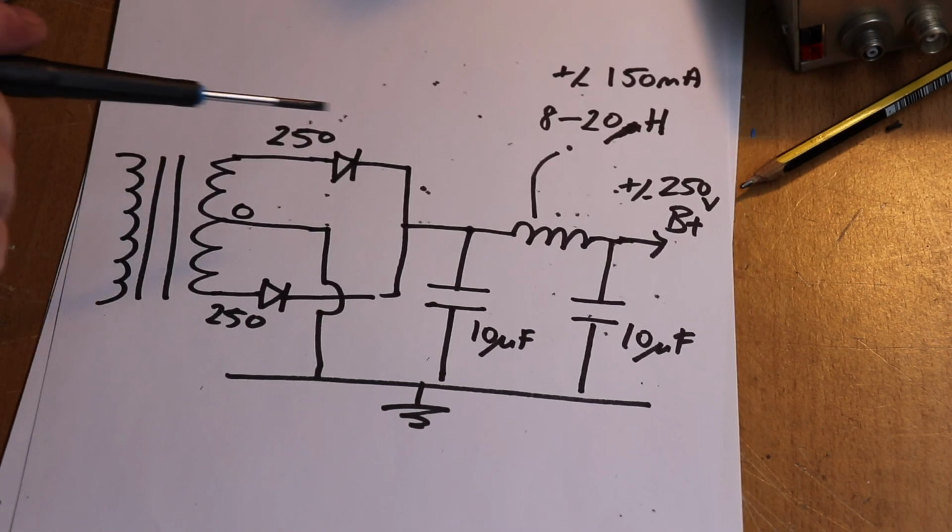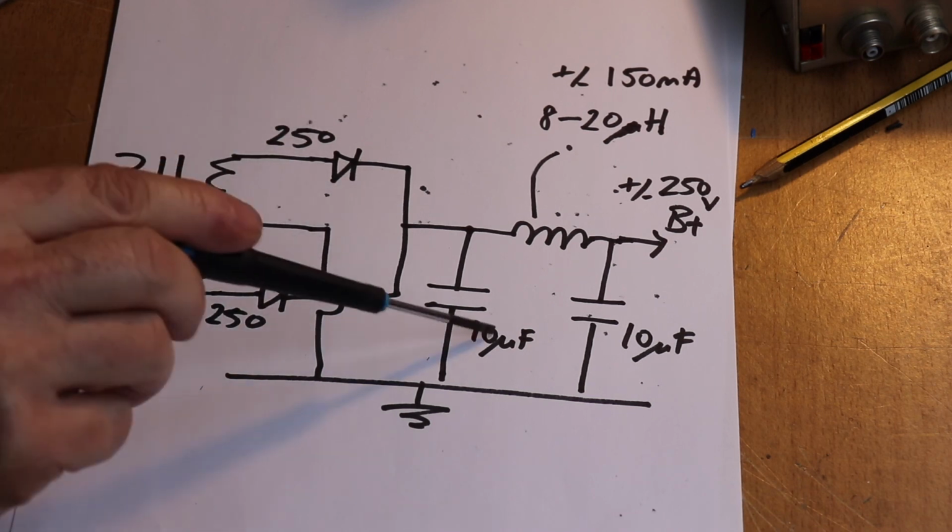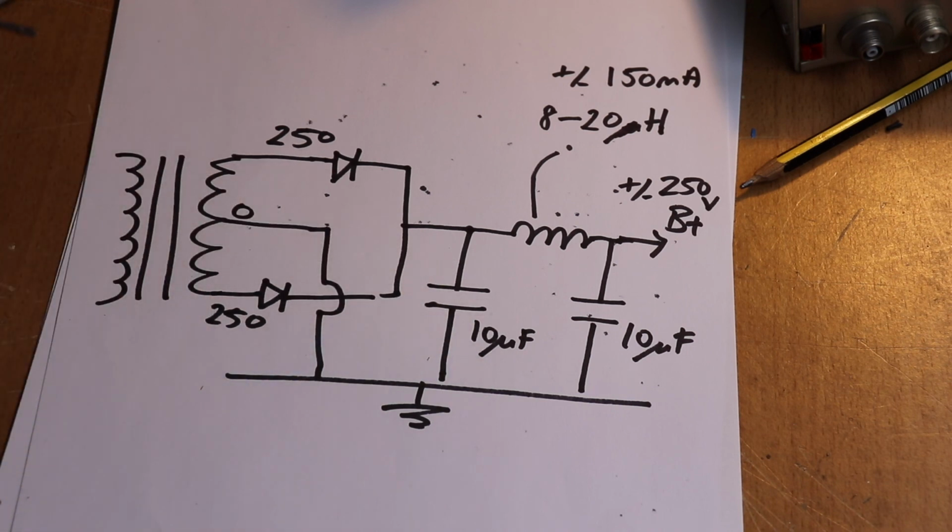You can if you want, but for most DC supplies, you use a bridge rectifier or something like this. But you use a much larger value capacitor, so something like 10,000 microfarad, at, let's say if it's 12 volts, something like 24 or 25 volts. If it's 24 volts, you're using maybe 35 volts working, something like that. So that's the difference between the LT supplies and the HT, but I'm going to be concentrating mostly on HT supplies.